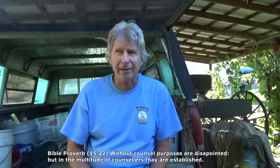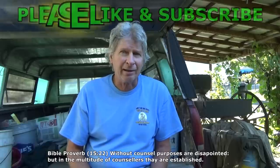I make my old school bonding agent, just get Portland, mix it with water, wet it down, paint over it, and I'm done. I wait 30 days if it is possible. Usually you read the directions on the can. And I use a flat paint, a flat masonry paint, a good flat masonry paint, and I never had a call back and never had a problem.